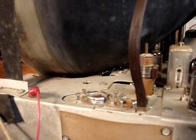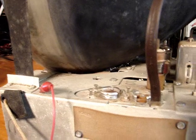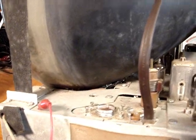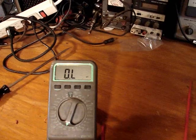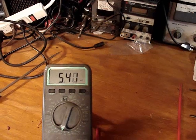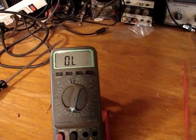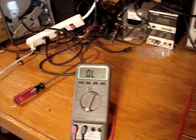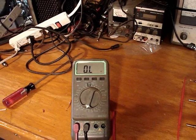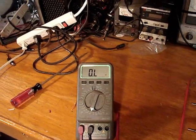I wedged a piece of folded-up aluminum foil between the spring and the CRT. I think it will stay in place — I don't see any reason why it will come apart. At least that will do for now. As you can see, I have electrical connection now to the outer coating of the CRT, which I didn't have before. And that's important. So I would say that more than likely what I thought was ringing in the raster was probably due to the fact that there was no electrical connection from the outer coating of the CRT to the chassis.